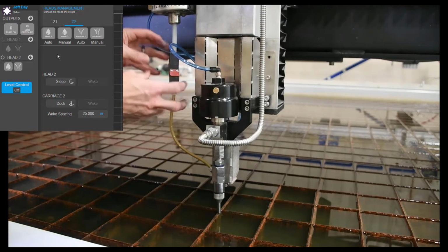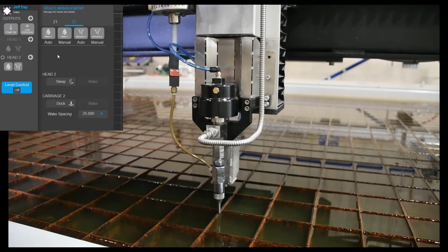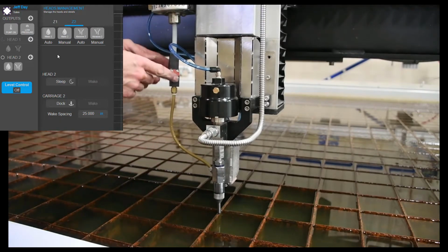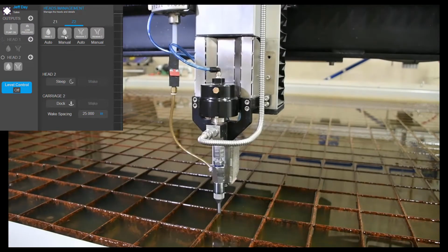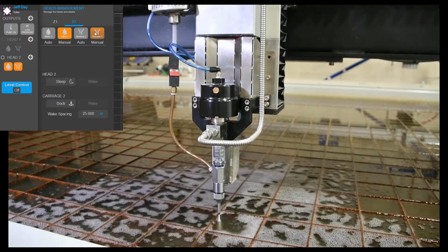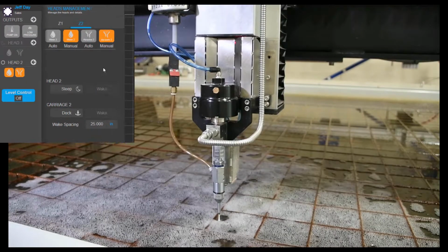This anti-backflow device, normally I have blue covers on here to protect this. I like to have it off for these videos, to see what's under there. So the idea with this is if you get water backing up here, the water can escape out here before making its way all the way up into the mini hopper. So now we'll just run water and then some abrasive. And abrasive appears to be flowing well, so we should be good to go now with that.